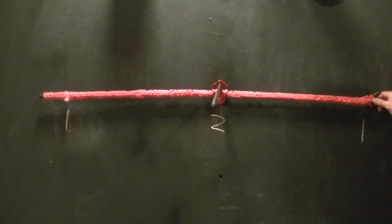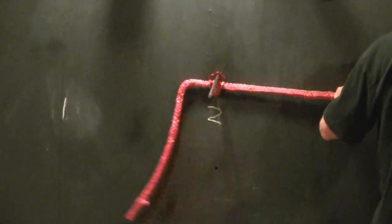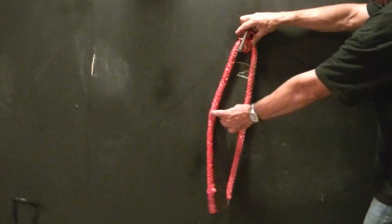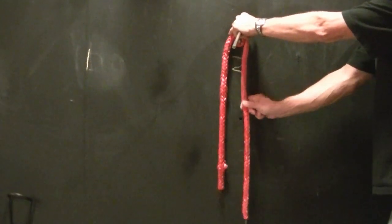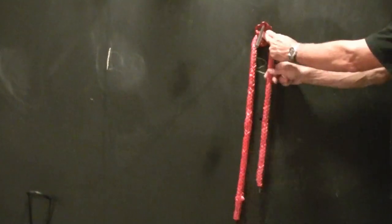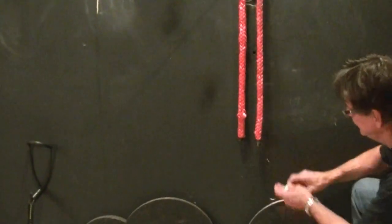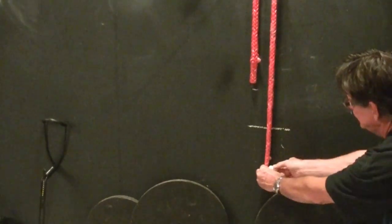Here is our lever again. Now we're going to convert this from a lever into a pulley system. Now we have the same configuration, the same everything. There are the two sides still doing the work — just like in the lever, there's one pound here, one pound here, and it applies a two-pound load in the center. If I pull down one foot, that other side goes up a foot. It's exactly like the lever, but now we're just pulling the load through the pulley. If we pull down a foot or six inches, these distances will be exactly the same.